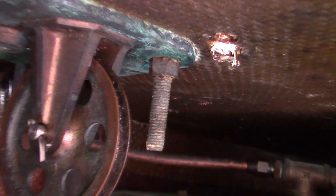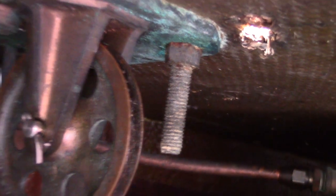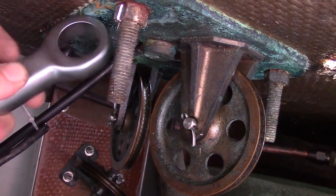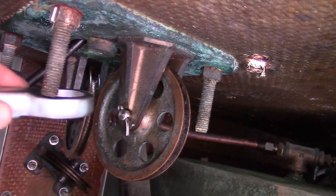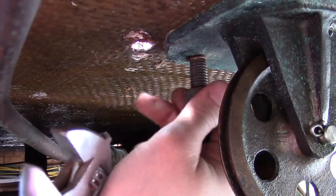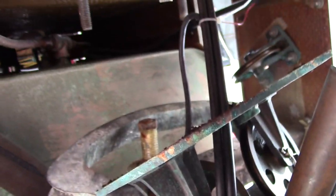It is now time to remove the pedestal. If the nuts on the pedestal bolts are frozen, try a penetrating oil or a nut splitter, as shown here. With the nuts split or freed up, remove them from the bolts. Be careful when removing the last one, as the idler plate will drop. Note that the Vision 2 pedestal uses a new idler assembly.